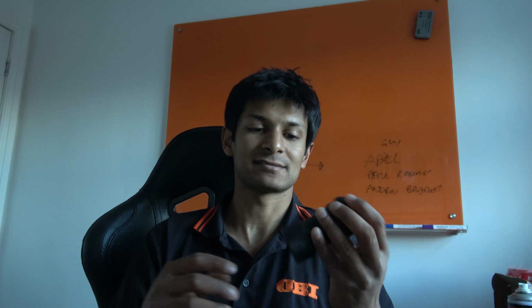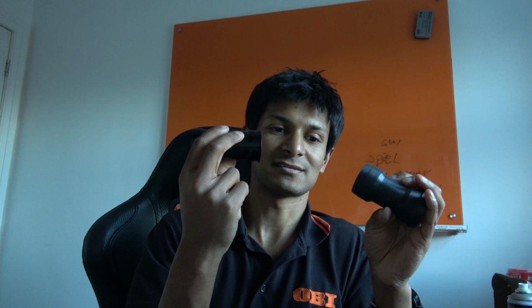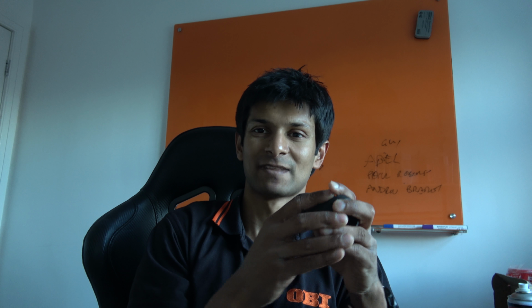I suppose the extreme end of this is plastic. So this is a Delrin bottom bracket, and the Delrin bottom bracket has the same interference as this, but I wouldn't be able to do that on this racing bottom bracket. There's no way I could do it. But with a Delrin bottom bracket, same press fit level, you can just push it in and out, and that's the issue with a tolerance stack up.